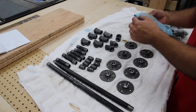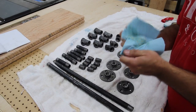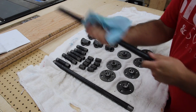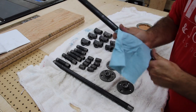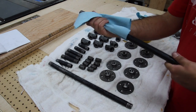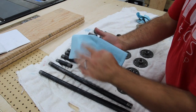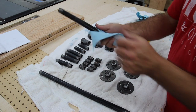When I get done, I'm going to add a little bit of paste wax to the pipes themselves. This is good when you are making pipe clamps so the clamps slide easy, but I also found it kind of seals that coating in place. Here I'm just demonstrating with a clean paper towel — I wipe it and you see that nothing hardly comes off. So this does work just with water and some paste wax.